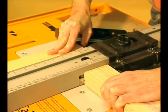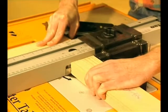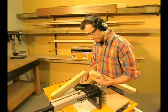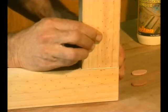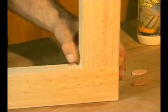The two slots will always line up perfectly without any measuring, marking or confusion. And to make it even easier, you can adjust the joint before the glue sets because the biscuits are slightly shorter than the slots.